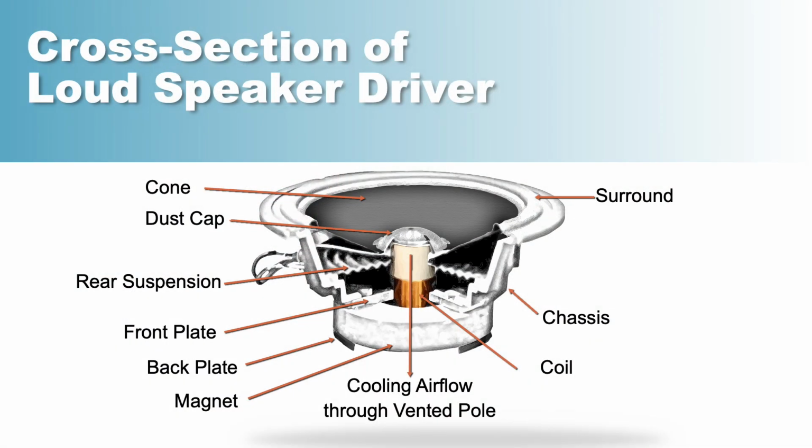Last week we covered the basics of how your mixer is laid out and how it all functions. Now that all of your sources are mixed to your liking, we need to send that signal to your speakers. A speaker driver effectively works like a dynamic microphone, but in reverse. Instead of capturing vibrations to turn it into an electronic signal, you take the electronic signal and turn it into vibrations. This works by connecting a magnet to a driver cone and sending an electrical signal through the copper coil wrapped around the magnet. With enough electromagnetic force, the driver will vibrate enough to project sound.